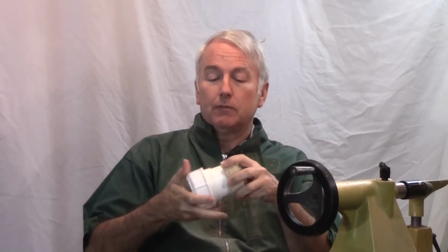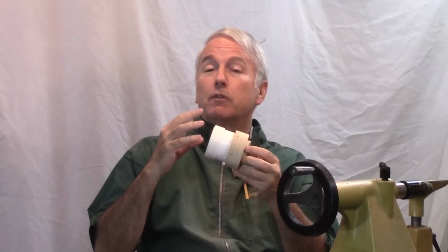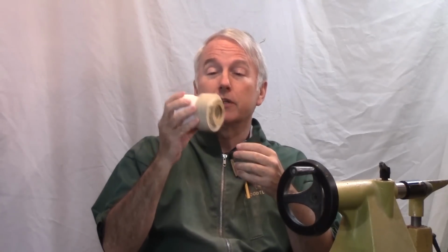Promptly put it into the lathe and cut it in half. Now, my half I have mounted into a threaded wood faceplate. In the initial diagram, he put it into his four-jaw chuck. I don't want to have to change jaws. They always have the wrong set of jaws in my chuck. So I dedicated a threaded wood faceplate to this. It's glued in with a little CA glue.